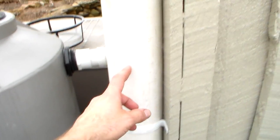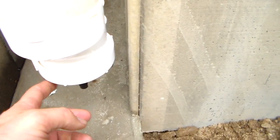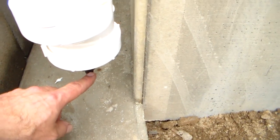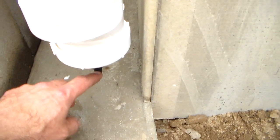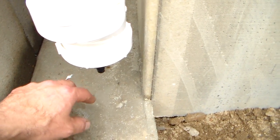The reason there's a weep hole in here is for freezing. If you didn't have this and the pipe froze, you'd definitely break your pipe — but with the weep hole, it slowly leaks out. You do need to check this, because sometimes it gets clogged up over time. If it doesn't weep out and you get cold weather, you can break this system.